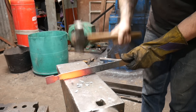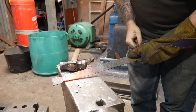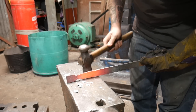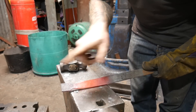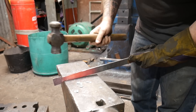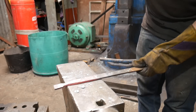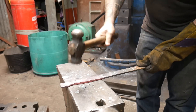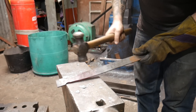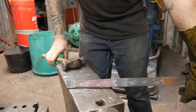I'm also going to leave the material — I don't want to forge off the anvil. If it's on the anvil and I hit it, it will bend and change direction. If I don't have it on and I hit it, even if I accidentally hit that piece, nothing's going to happen to it. First rule: keep it straight and parallel, and look nice and tidy.